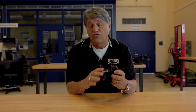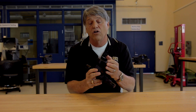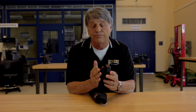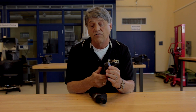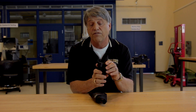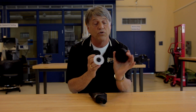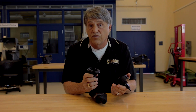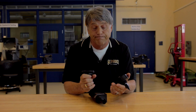We have the industry's only standard high-low check valve. What that means is you get two check valves in one: our high-pressure check valve, which will handle up to 300 psi of back pressure, and our secondary check valve, which is a spring-opposed diaphragm up against an o-ring. That will prevent water from backing up into the rotometer or the vacuum regulator, and the spring is guaranteed for life.